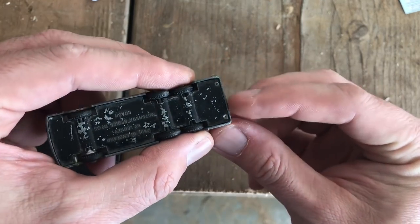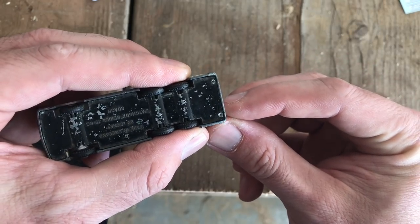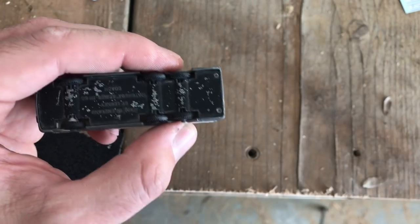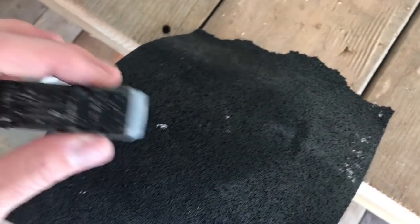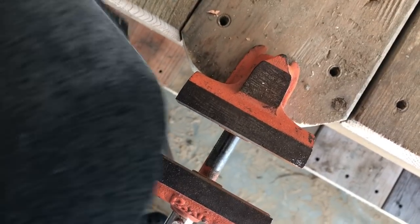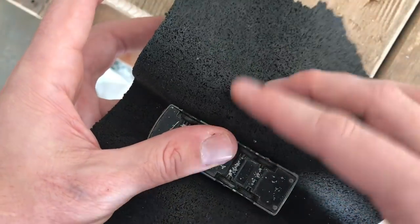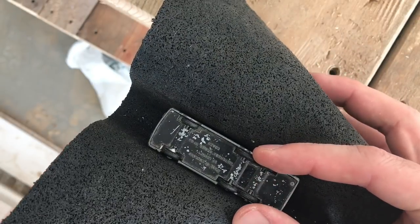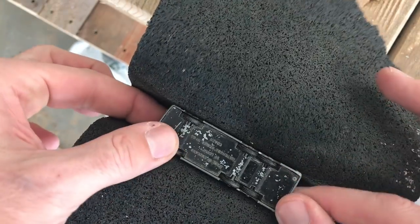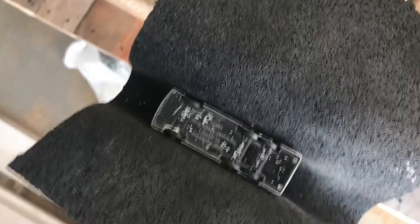To get this apart, you can see there are two very small rivets in the back that we're going to have to drill out in order to take the base loose from the main body casting. To do that, I use a small bench vise. To protect the casting, I've got this rubber mat — a little rubber sheet — that I'll put in. I'll get that cranked down just to hold it secure, but not too hard, because I definitely don't want to crush the sides or bend the casting.